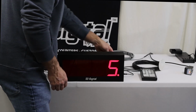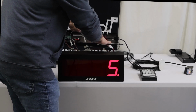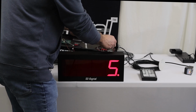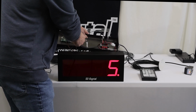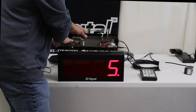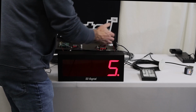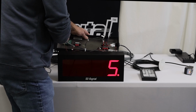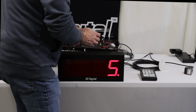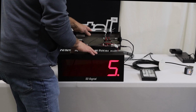And then internally there's another 485 connection and also terminal blocks for your sensor, and that's all well marked, and then output to your secondary, and then all these are modular connected so you can separate the front from the rear, and then our relay outputs 1, 2, and 3, and then our interface board to operate the sensor is also mounted on the back plate. You can enter wire from the back, center of the back, or the left side if you want to add your cabling connections or your conduit. It can be hung on a 4-square or handy box, and there are keyhole knockouts for that.